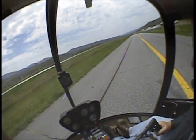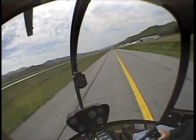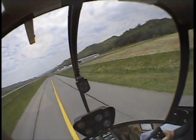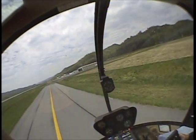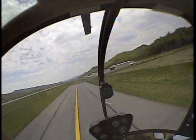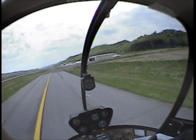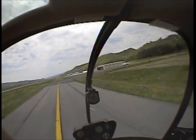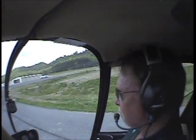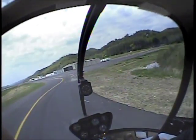Give you more of a workout. Don't fixate too much on that gauge. But see — if we had started with the RPMs already up, let's bring them down just a little bit, Don. There we go. From this point on you can just simply fly. If we had brought it up to 100% before we started bringing in the collective, we would have had to roll the throttle down a lot to prevent it from overspeeding, because there was no drag on the blades yet — you're introducing more fuel to compensate, and there's no governor to naturally roll it down. Gotcha. Makes sense.